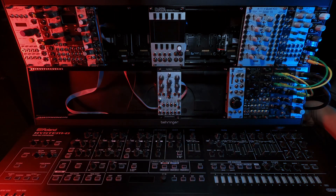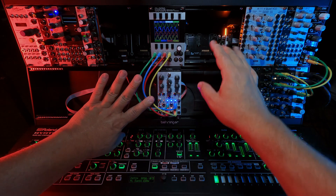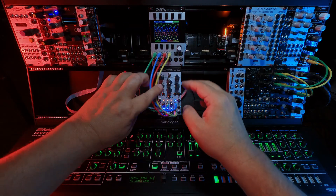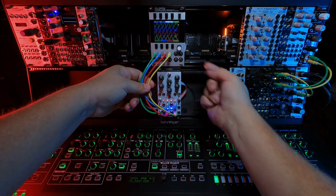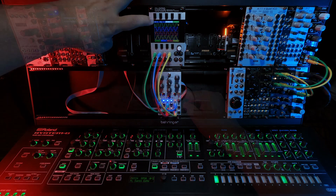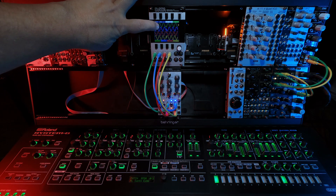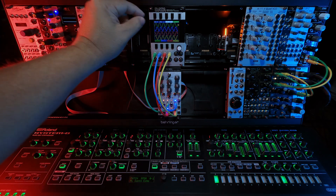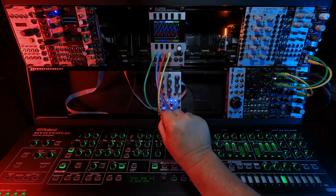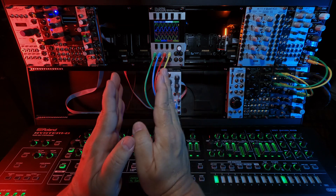Filter 8 is in the rack — let's get some power to things. For this first piece, just showing the 90, 180, 270, and 360 phases of the outputs for LFO. We're in low mode, resonance cranked, hold is turned off, compensation is turned on. What you see on the scope is wherever the green trace is — that's the 90-degree angle, and then there's the 180, 270, and 360. You can see how the peaks are offset. If I take the yellow one out of 360 and put it into 225, you can see where it now moves behind the red, because it is now in the phase behind the red.